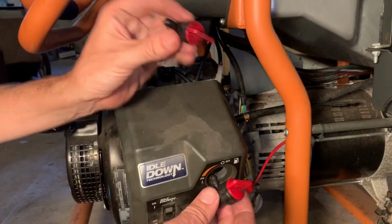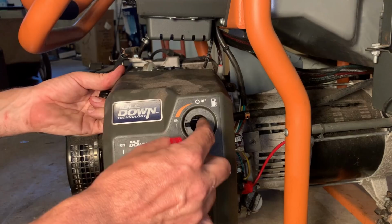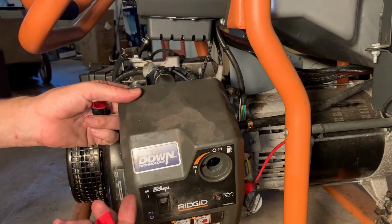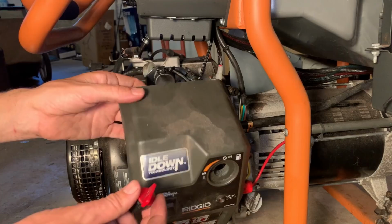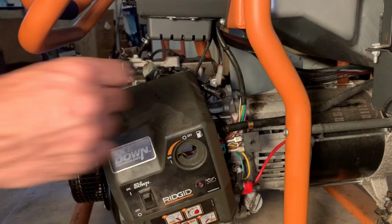So unfortunately, this other valve I have is the tiniest bit larger in diameter. So when it goes in, it goes all the way in, but it's such a tight fit that you can't turn it. First, I thought it wasn't going in all the way because it does need to clear right there, but that is not the issue. It's the wrong size, and I don't have any others with this 90-degree configuration, so I think what I'm going to have to do is just put this one back in just for show, and I'll replace this fuel line and do one continuous line right from the fuel filter to the tank, and I'll add an inline one right there.